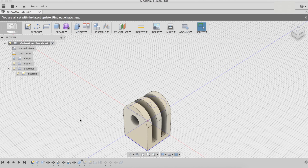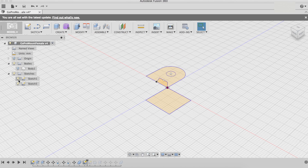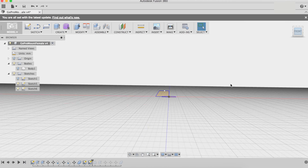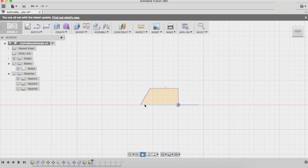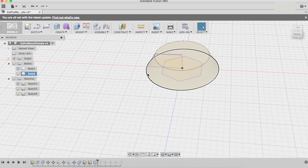We move into a different sketch to make the holder part for the acorn nut. I had to design it in a way that would be easy to print. I used an inclined surface that I'm going to revolve — when it's vertical, the overhangs are limited. Then I subtract the extrusion from the hexagonal piece where the nut is going to go.